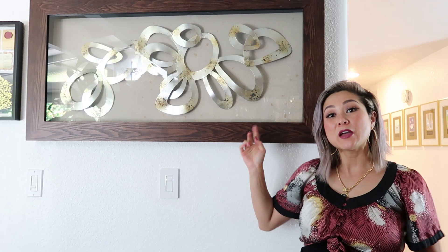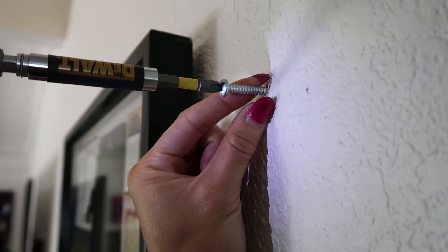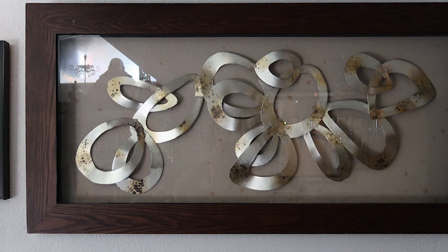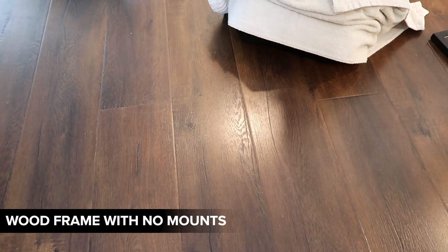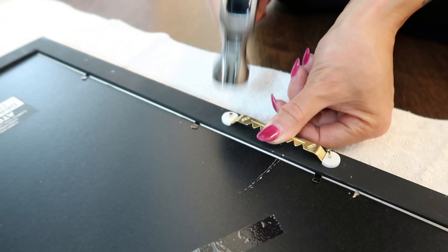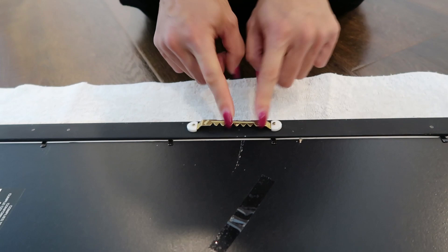For heavier items like this 50-pound picture frame, you definitely need two people to help. Some wooden frames like this come with no hardware at all. What you want to do is lay a towel on a hard surface like the floor, place your frame with photo side down, and use a basic sawtooth mounting hardware and a hammer to hammer it right in. You want to secure it with your thumb, hammering both sides. There's no need to measure if the frame isn't too large — just try to eyeball the center.